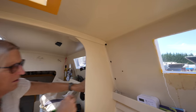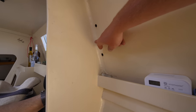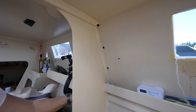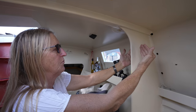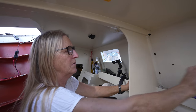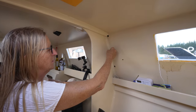Because I don't know if... Because obviously you've got a fillet here. But there's damp brown stuff there, which is not great. So would there also be a fillet on the inside next to the insulation? Well, originally, what happened was you would have the outer plywood, the bulkhead against it, and fillets. And there was a stringer here. But then he's filled in the space and put this one on instead.